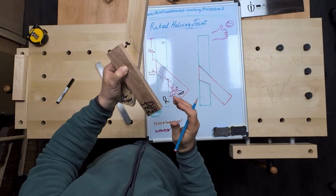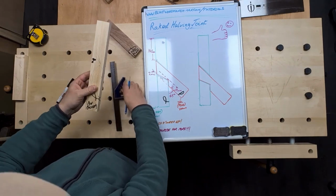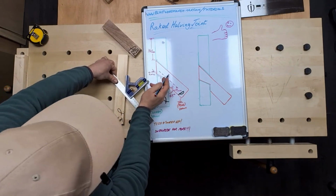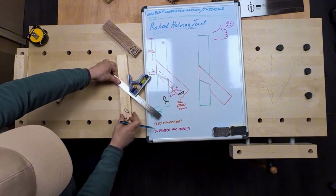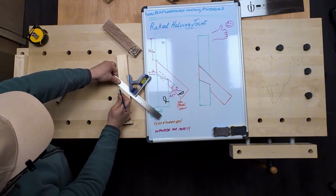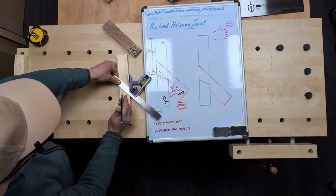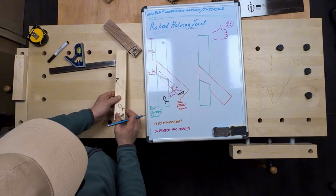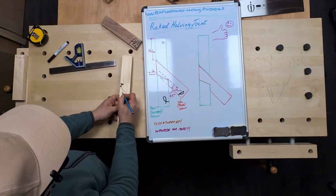When we have that marked up there, we'll then take each piece individually and mark it with our combination square. This one, it's a straight line along the top. So make sure that this body is definitely against that edge. That's against the edge now. And we can mark a line in here. That is actually too far out on that one. There it is. Yes, that's a good thick line that we can see. With this is going to get cut down this direction. The top half is actually going to come out.